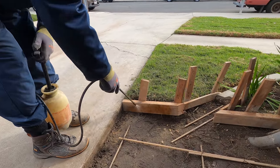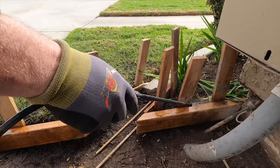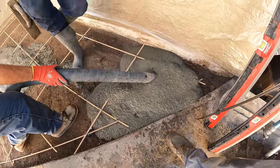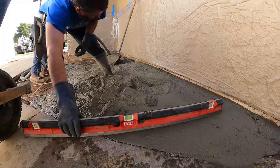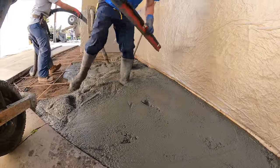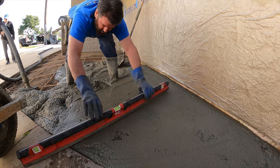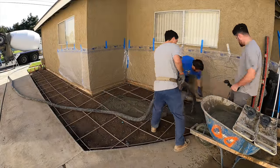The reason I'm not tying in is because there are so many cracks in that existing driveway already and it's pretty old — it's definitely going to come out before this new part does. In the original driveway there's no reinforcement at all, so I want these sections separated and not tied down together.